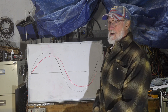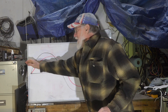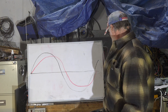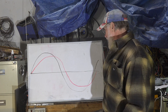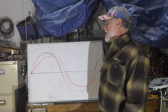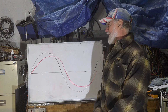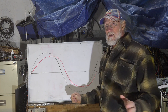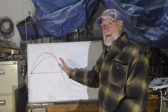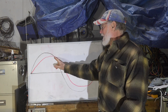These are not hard start motors. Hard start motors — we're talking everything single phase here — are going to require something like this, which is a start capacitor. This is a much larger strength capacitor than a run cap. It's not made to stay in the circuit for more than about half a second or so, and it puts the winding well out of phase because of its large strength.